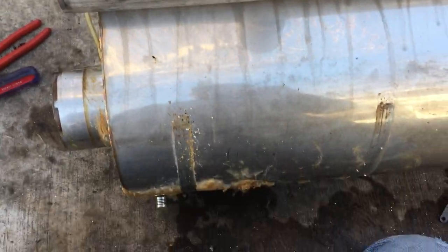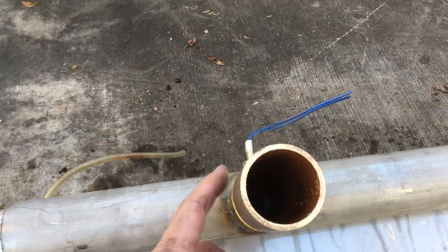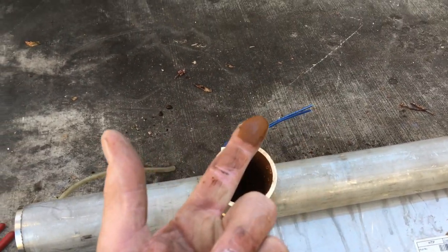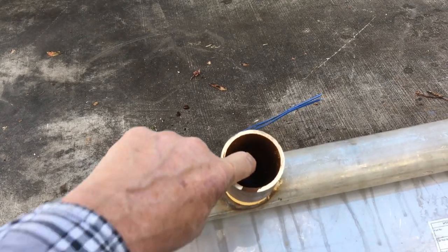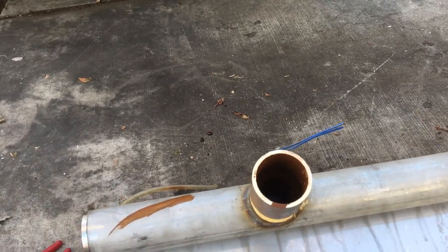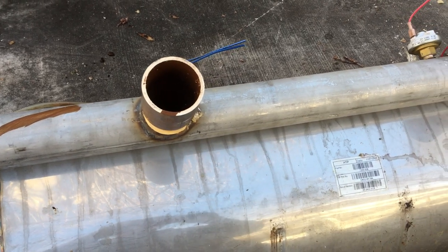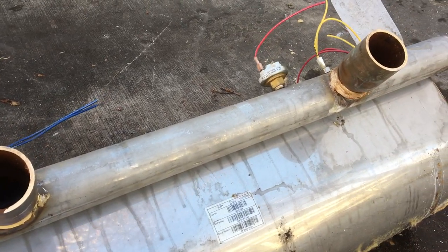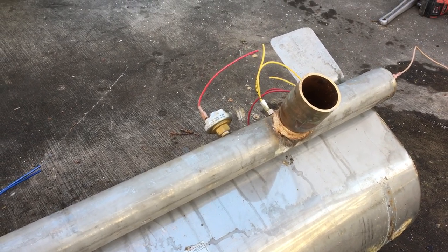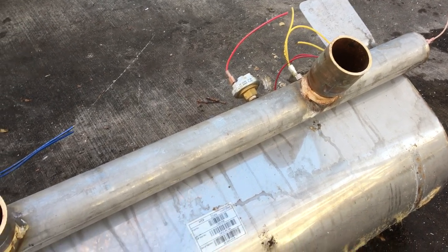I'm going to cut this open — I'm really curious to see what the waterways look like. These are brass nipples into the header and they actually have a pretty good coating; it's like a rusty film that coats the inside of those, which makes me wonder if the inside of the heat exchanger is coated with that also. They had a massive pump on this thing, so it might have really been zinging the water through there — maybe that velocity kept the corrosion buildup off of those tubes. We'll find out.